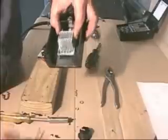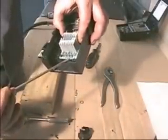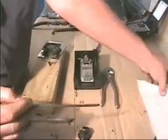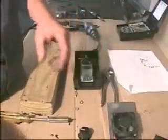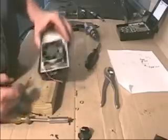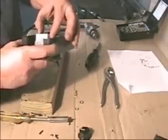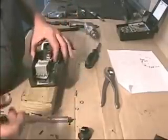These terminals here are the ones you're going to be using. The positive 12-volt right here is going to hook up to the red wire on the fan. The black wire is going to go to ground — that's going to power it up. It doesn't matter which way this fan goes; it can blow in or out. All you've got to do now is put this in and screw it together, and there you have it — the pulse width modulator fully assembled and ready to go. Thank you for watching.